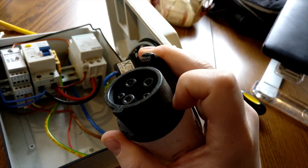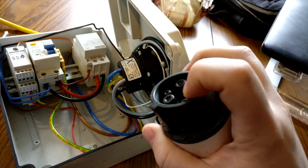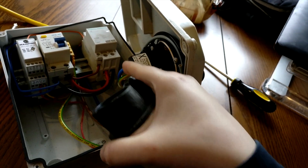The car has a set of circuits on board that checks its side to make sure everything is okay. This unit is a very basic set of circuits that waits for the right signal from the car to start charging. When the car says it's ready, and the charging station confirms there are no ground faults or other problems, it activates the relay and the car starts charging. Inside every commercial charging station is a set of circuits designed to make sure the car is safely plugged in, the plug is fully seated, there are no ground faults, the car is ready to accept charge, and the charging station is ready to deliver charge. If all those conditions are met, the charging process starts.